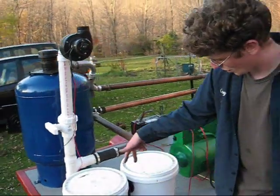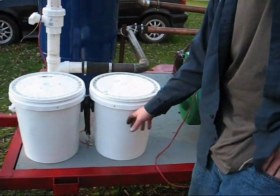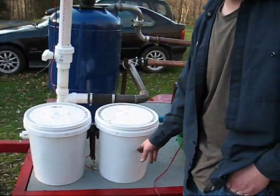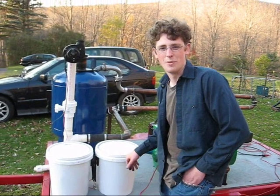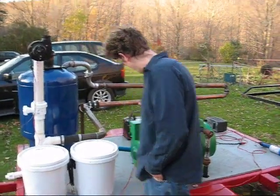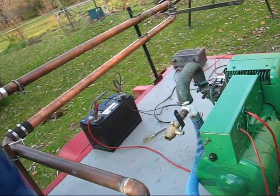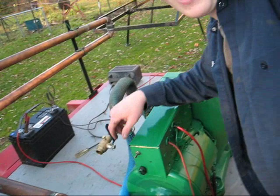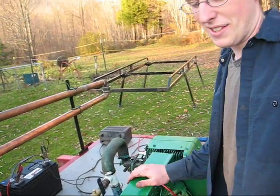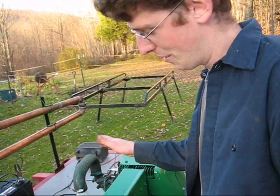Out of the filter bucket, joined between these two chambers, there's another filter bucket with a coarse hay filter, followed by a finer polyester filter before it goes onto the engine. It exits the bucket and goes to a mixing valve before the engine, which is at this moment just a basic valve. I can improve this design by using an oxygen sensor and doing automatic mixture control, but that's down the road.